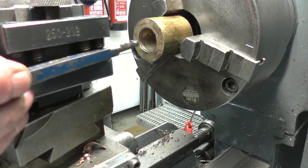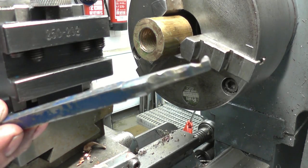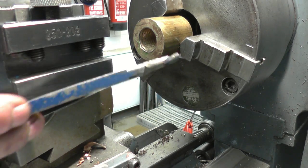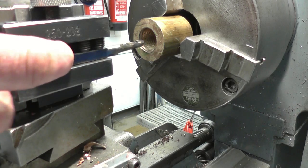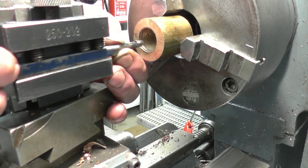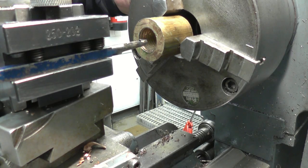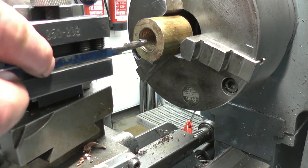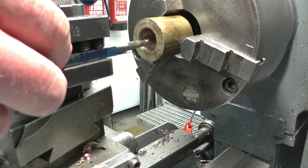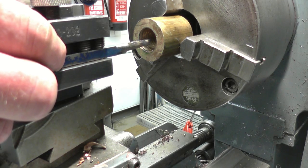Right, I've ground up another tool. It's a tip-boring tool I had — I think it was a Warwick screw-cutting tool. I've re-profiled it so it's going to cut Acme thread. I've got it set up at centre height, square to the job, and I can slide it in and out of the tool post. Now I'm going to try and pick up the thread — set the lathe with the tool coming out, move it in and engage it in one of the threads.